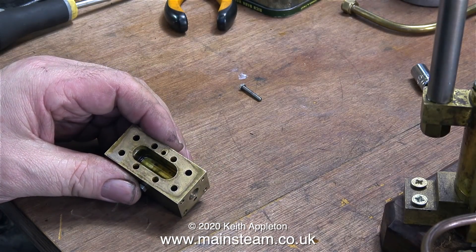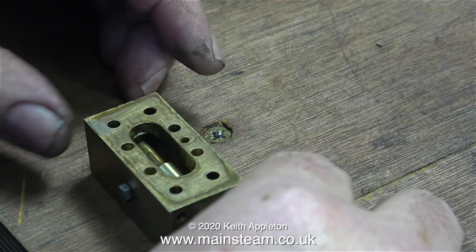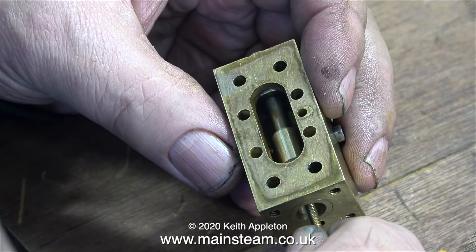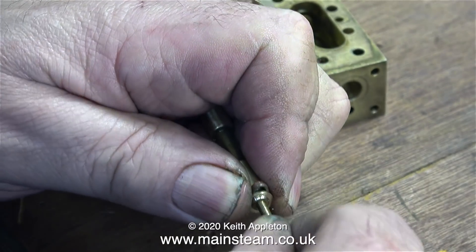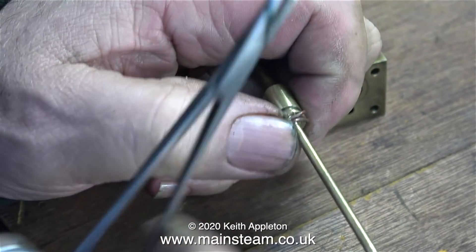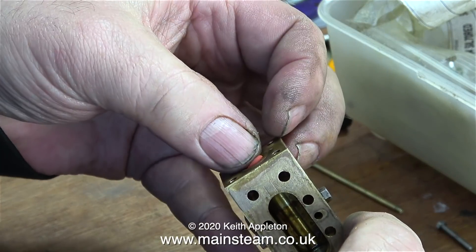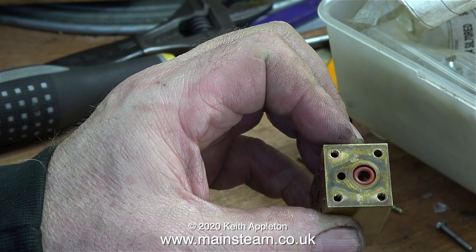I'm having a quick refit of the shuttle piston in the cylinder. To be perfectly honest, the o-rings feel a little bit on the tight side, and there are two at each end. Why two at each end? I would guess that when Don built this pump, maybe he didn't have any of the thicker five-sixteenths of an inch diameter o-rings in stock. I'm removing the o-rings — you just squeeze them together and pull upwards. These silicone o-rings split and tear very easily, so you must use a blunt tool to remove them. Here you can see the two very thin o-rings. This is my box of silicone steam-grade o-rings and I have a good stock of five-sixteenths o-rings — this one fits the cylinder perfectly.